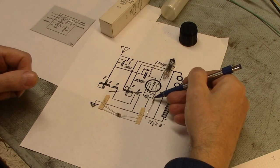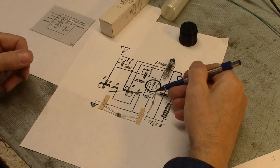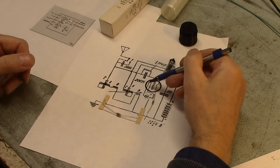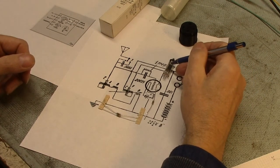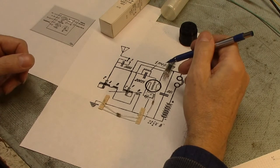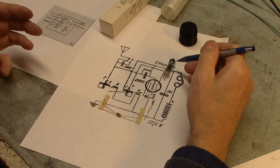I'll try the shunt first, and also the series since I'm only running on batteries. Scott's using an 8 ohm resistor and I think I could drop it a little further for a bit more performance. Just like the old days, you don't want to crank it all the way to highest volume or you'll burn out the filament — the last bit probably doesn't give much gain anyway. Looking at the data sheet for the 5676, it turns out it was actually designed for a push-to-talk walkie-talkie, with absolute conditions of 1.25 volts at about 125mA, giving 100 hours of use.